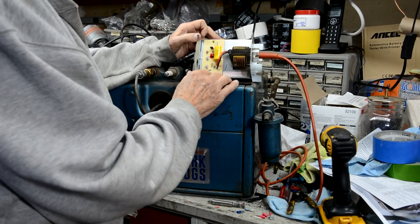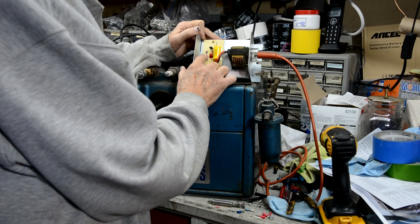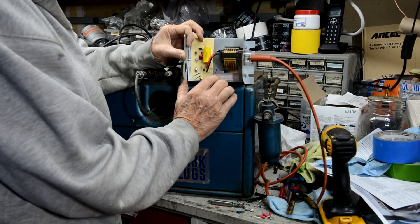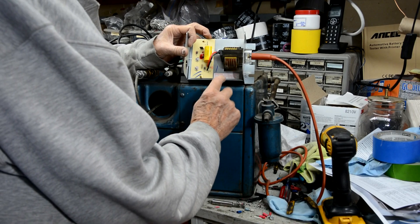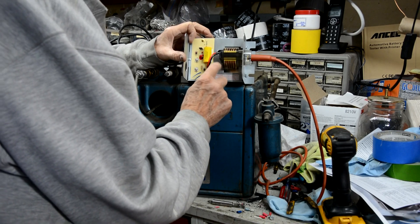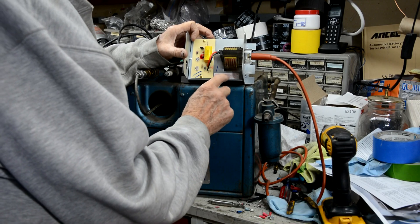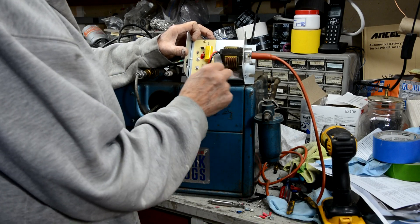Inside there's nothing really telling you what's going on, but I'm assuming T1 and T2 is where you hook up the 120V. There's an interesting warning here that says to ground the chassis at all times even when bench testing — and they don't provide a ground terminal. So I'll have to put one in myself, but you'd think at least for bench testing they'd have a ground terminal.